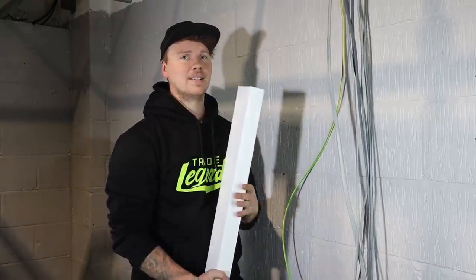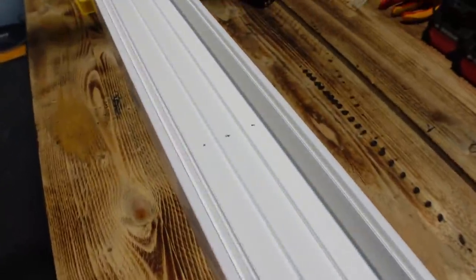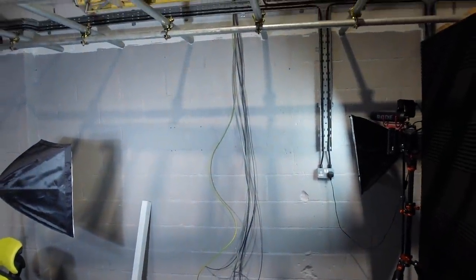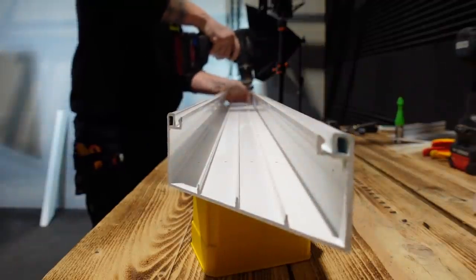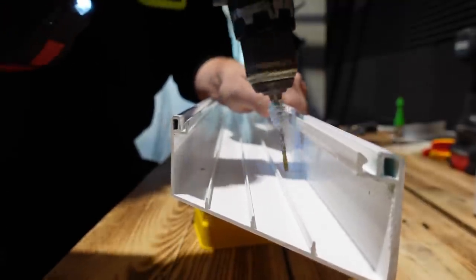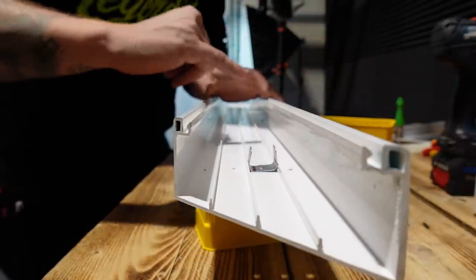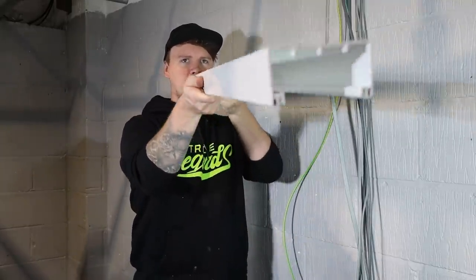Bringing it down, we'll bring it on the 90 bend and then it will come up and under into the fire-rated grommets at the bottom of the fuseboard. So we've just raised up my 4x2 trunking, marked out our four notches on each one with a little wood bit. We'll pre-drill these, pop it on the wall with a level, mark it through - and the fixings for the D-line clips will also be the fixings for the trunking on the wall, because there's going to be 12 of them. This trunking is actually perfectly made - the D-line clips fit perfectly in between the separations. We've got our trunking, we've got our 45, and we've got our holes in the back.